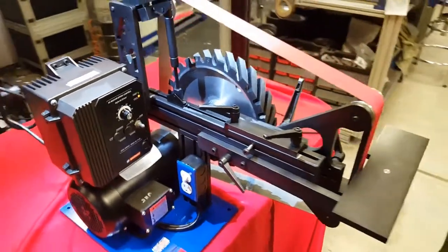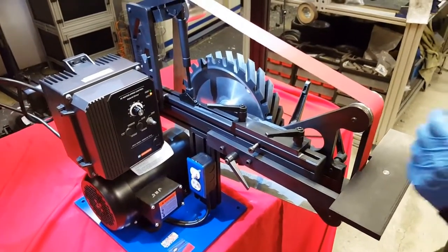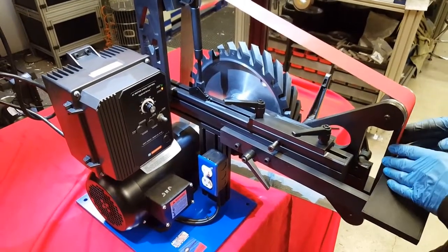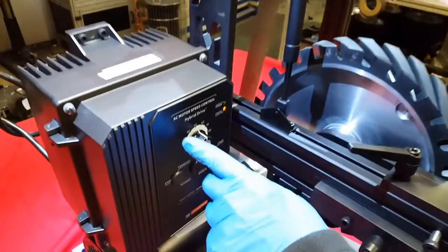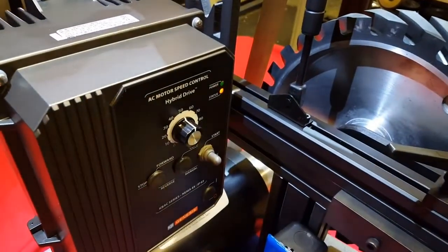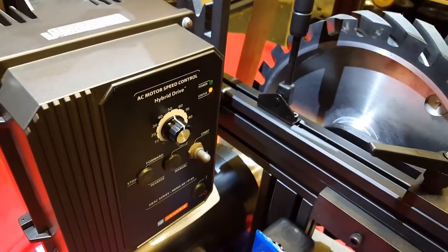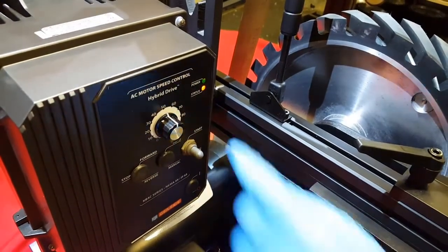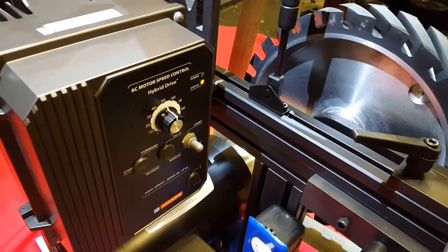And that is the basic setup of the AMK 77. One last thing. The best operating range for probably anything that you're going to use the grinder for is going to be between 40 and 70. And what that gives you is 40 is going to be roughly about 1,200 RPMs, and 70 is going to be somewhere in the neighborhood of about 2,200 RPMs.